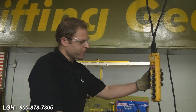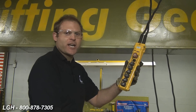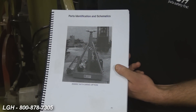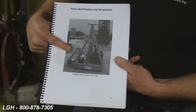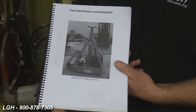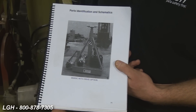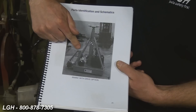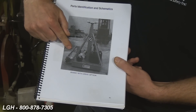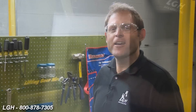That's why the pendant offers features such as simultaneous operation and being able to operate each jack independently. If your unit comes with the optional integral drive, as shown in this photo, it will allow you to move the unit back and forth, but not up and down at the same time. To switch to the function that allows you to lift up and down, there's a valve located on the top. Also, there's a ratchet that allows you to lower or lift the adjustable wheel in the front.